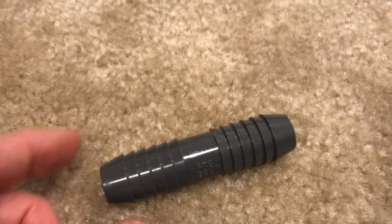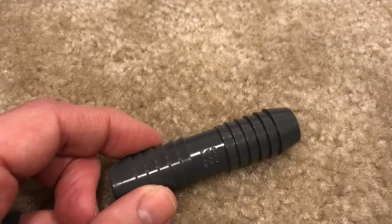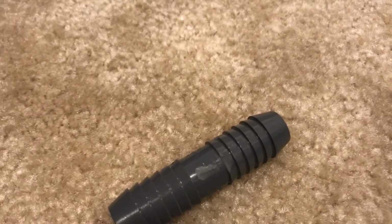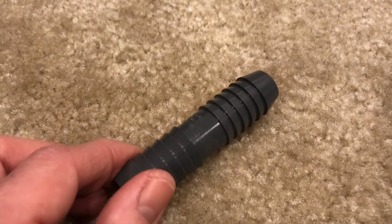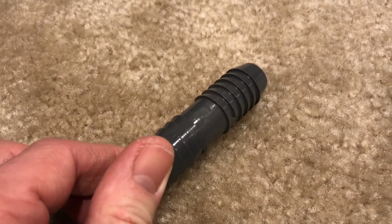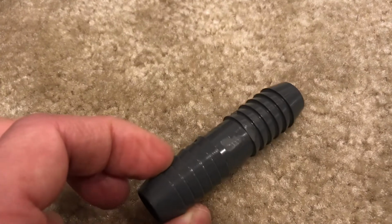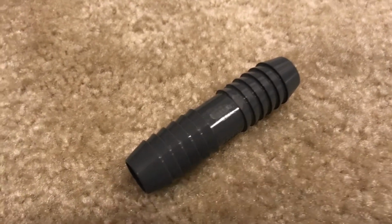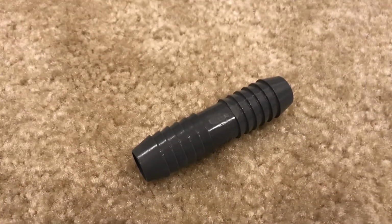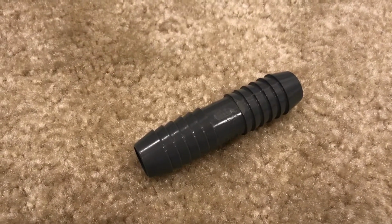They use it for these hula hoops that you can fold up into a figure 8, but you gotta grind down these little tabs on both sides, and if you get a little carried away and there's grooves in there, they will create a stress concentration. They'll fatigue as you're hula hooping. Even with small stresses, they'll eventually cause a crack to grow and they'll break in half.